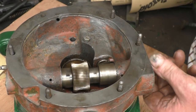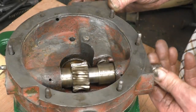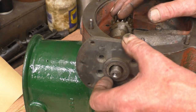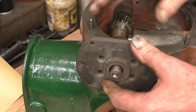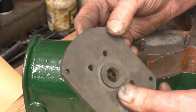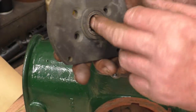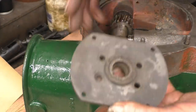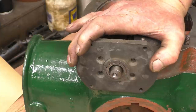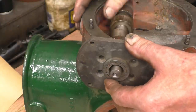The bad part was in here — this pin — and the pump in there; I had to put heat on to get it apart. You can see how the casing here has been eaten away with the rust, but the top half is still good. This plate supports the cylinder oil pump that goes in there with the gasket. I managed to get some new BSF countersunk screws. That's what's left of an oil seal in there — that will have to come out. The leather oil seal — you can see how badly pitted this is. The Evapo-Rust has taken all the rust out of it completely, but the oil seal has no grip left on the shaft, it's doing nothing. That's what drives the oil pump — a little ratchet goes onto there, a little pawl goes onto there, which drives the ratchet inside the pump.